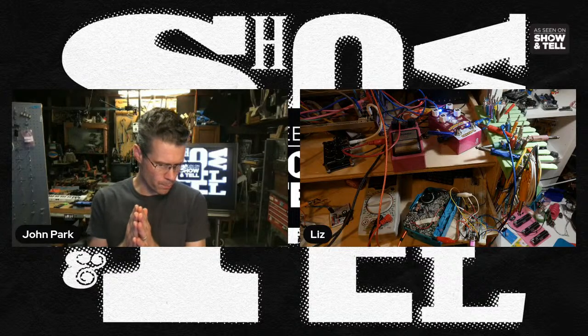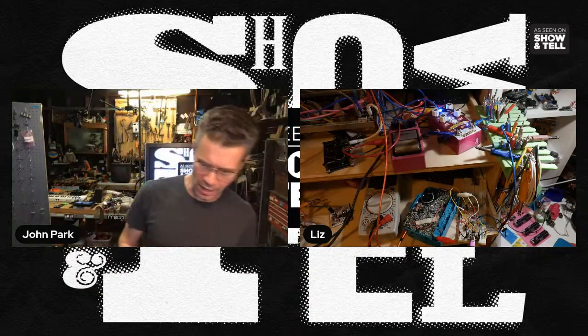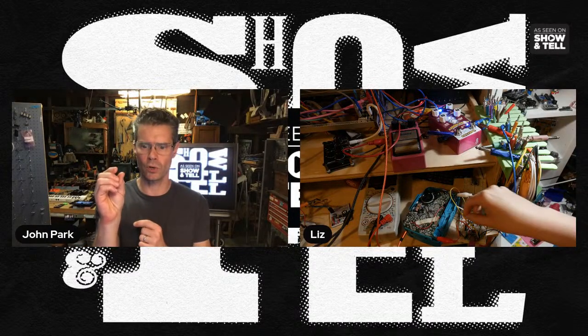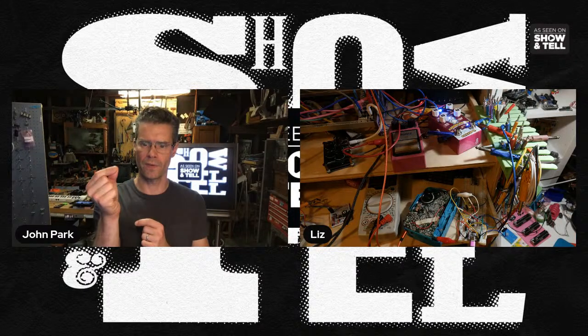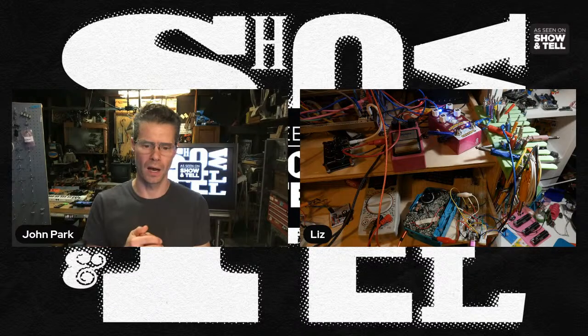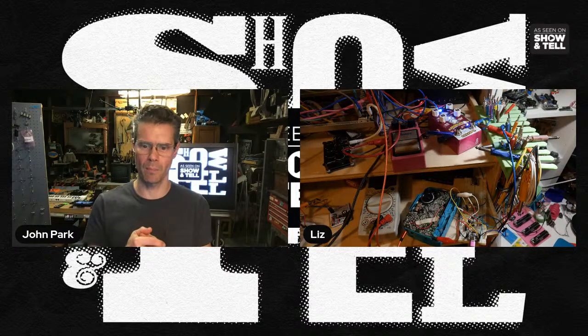So the blue deck there, I have one here somewhere. I've now lost it. Liz and I have been playing around with some of these, and that one has its own little motor controller on it that doesn't allow you to change very much the speed. It's basically got a trimmer pot in there that was designed just to allow them to tune the thing at the factory. So you've gone that extra mile and said, okay, goodbye, dumb motor controller. Here's a way better motor controller.